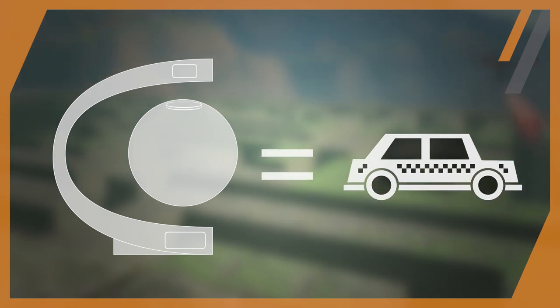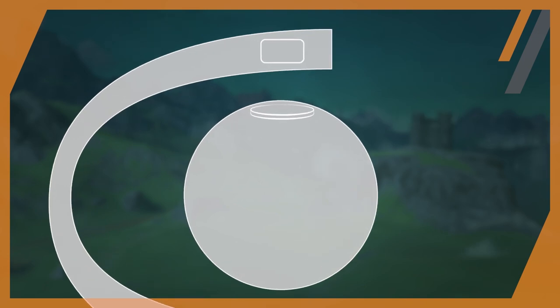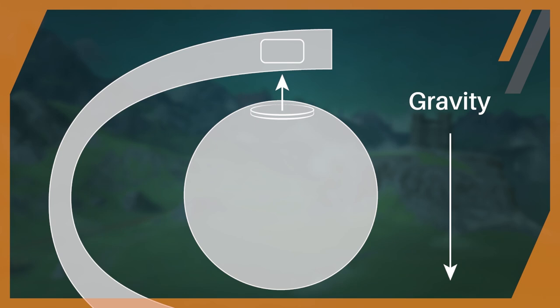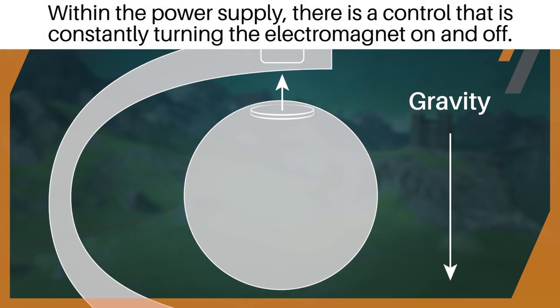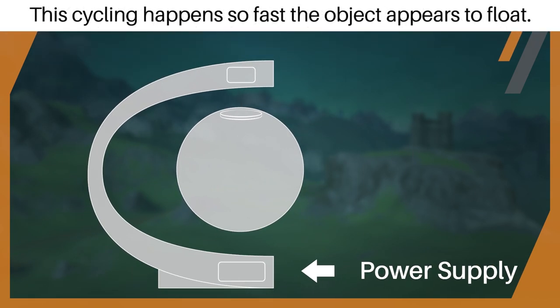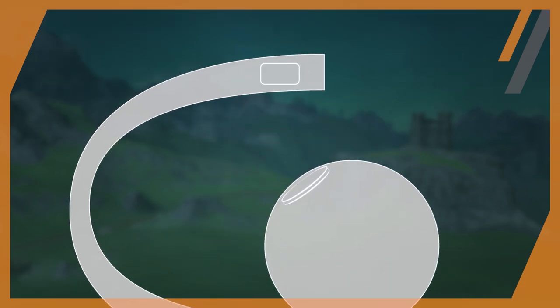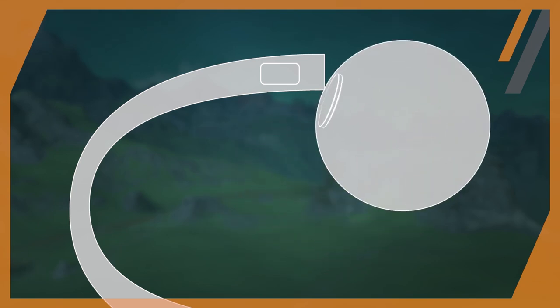Before diving into that, let's take a look at what is going on here. There needs to be a magnet positioned at the top of the globe, and an electromagnet on top of the curved part of the frame. Essentially, the magnetic pull of the electromagnet is being used to counteract the gravitational pull of the planet — what you're left with is an object seemingly levitating in place by magnetic force. However, the shape of the magnet inside the globe plays a large role in maintaining balance; if this magnet wasn't circular and flat, it could easily flip to one side and break this balancing act.